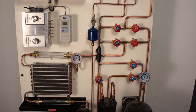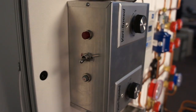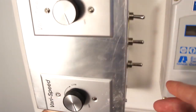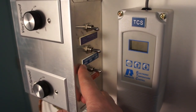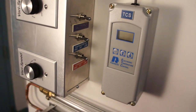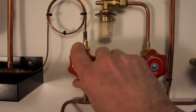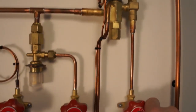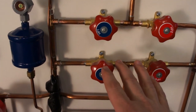Let's do a little walk around the trainer and I'm going to show you some things we would do before we get it started up. On the side of the trainer right here is the master switch, which turns the power on or off for the entire appliance. Over on this side, we have a couple of controls for the compressor, which I want to make sure are off. My evaporator fan is set off right now — I'm going to go ahead and turn it to high. I'm also going to turn my condenser fan on high, so those will start when I turn on the master power. I also want to go through and generally check my valve configurations. I have three metering devices here and I can tell these are off. This one is turning, so I know that my TXV valve up at the top here is open. I've gone through and checked the rest of my valves to make sure they're in the proper locations and everything is going to flow the way that I expect.